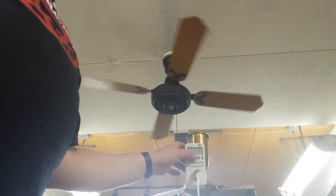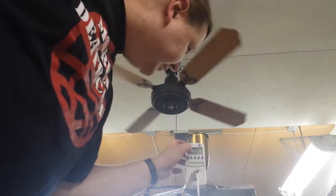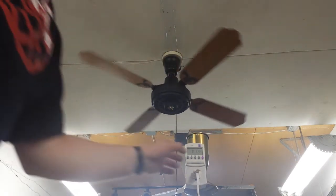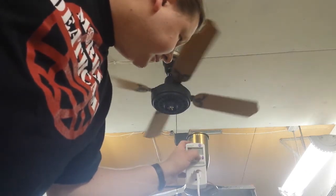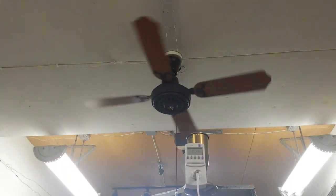3 watts. So let's just think about it. If you were to have it on that speed and the current draw was what? 0.16. So what you would assume that would draw would be 20 watts, which is not a lot. But even so, the difference between 3 watts and 20 watts. So solid state low speeds are a lot less wasteful than I thought they were. That's very good to know.